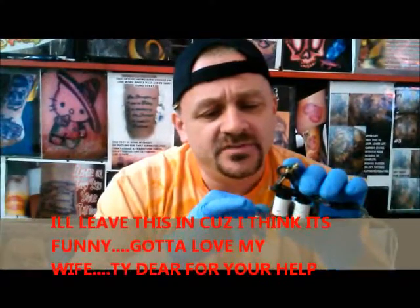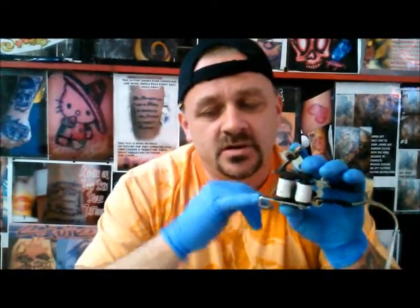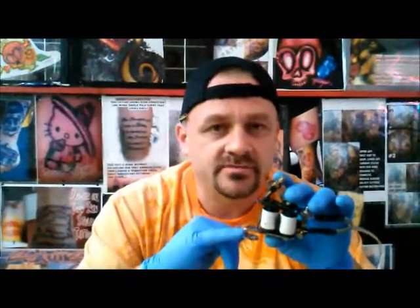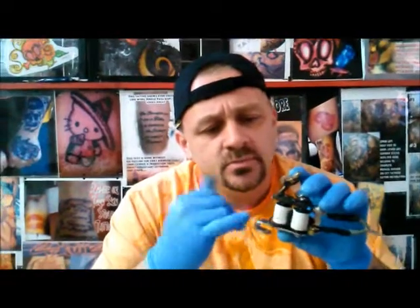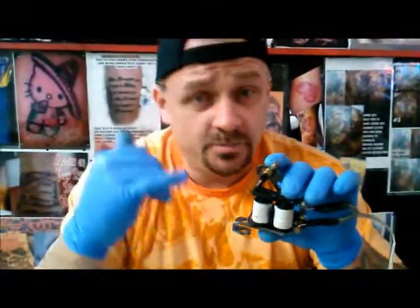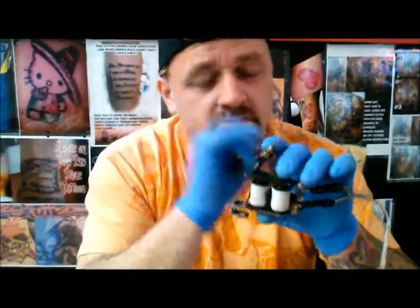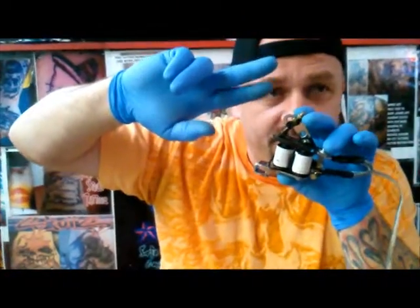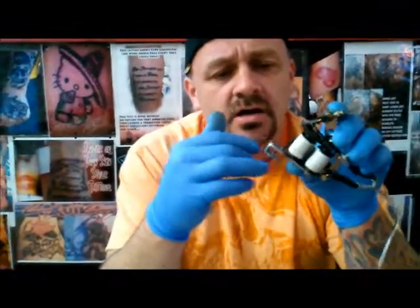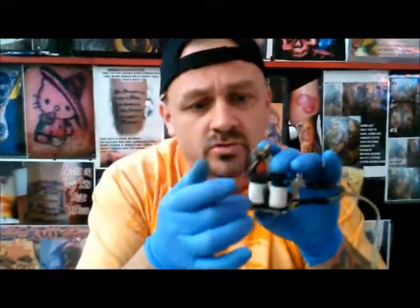Okay, we've got the machine reassembled, and in the beginning of the video, I let you listen to how this thing sounded like an old 1972 wooden roller coaster, clack, clack, clack, like a train wreck on top of a train wreck, okay? We've taken the coils, packed them with steel wool to help close the gap in the coil where the 8/32 screw goes inside the coil core itself. Oftentimes there's a gap in there that's not filled due to shims being thicker and things like that, and shimming the coils will cause that screw to go more or less inside the coil core.